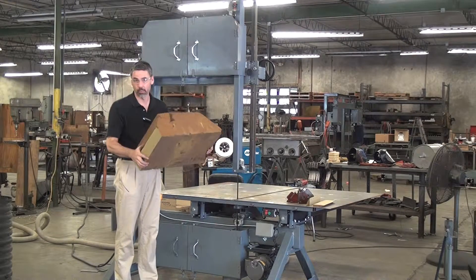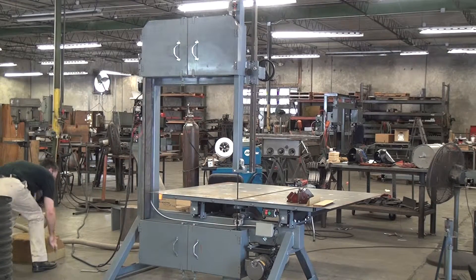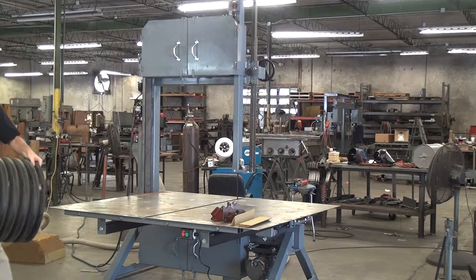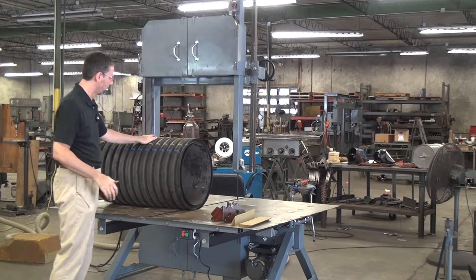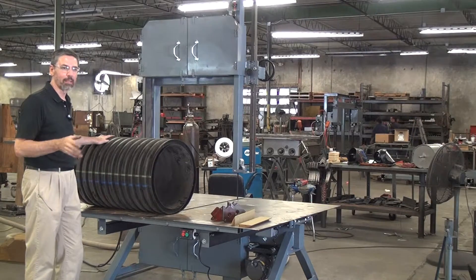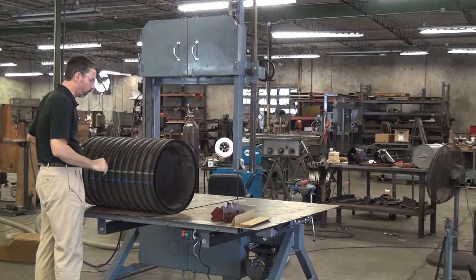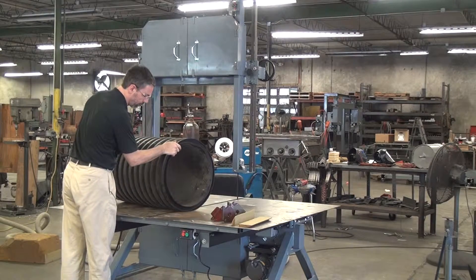A little cut foam — but my grandmother could cut this foam with a butter knife, so that's not much of a challenge. We'll do something more interesting. This is high-density polyethylene double-wall corrugated drainage pipe — a very common application for my customers. What they do a lot of times with this stuff is make mitered fittings: elbows, tees, collector bodies, manifolds. They have machines that extrude it straight by the mile, but when you want to make an elbow or tee, they use my bandsaws. The straight cut is not interesting — the angle cut is a little more interesting.